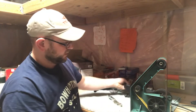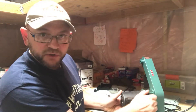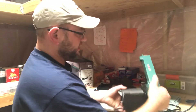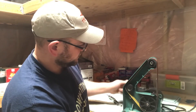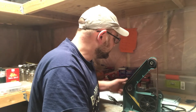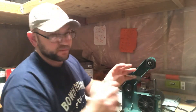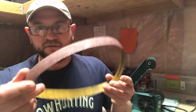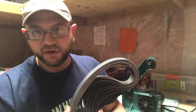Once the guard comes off, turn it around and undo the knob. Over here you've got another knob — loosening it takes tension off this pulley. Loosen it enough and you can rotate this off, and the belt just comes right off.